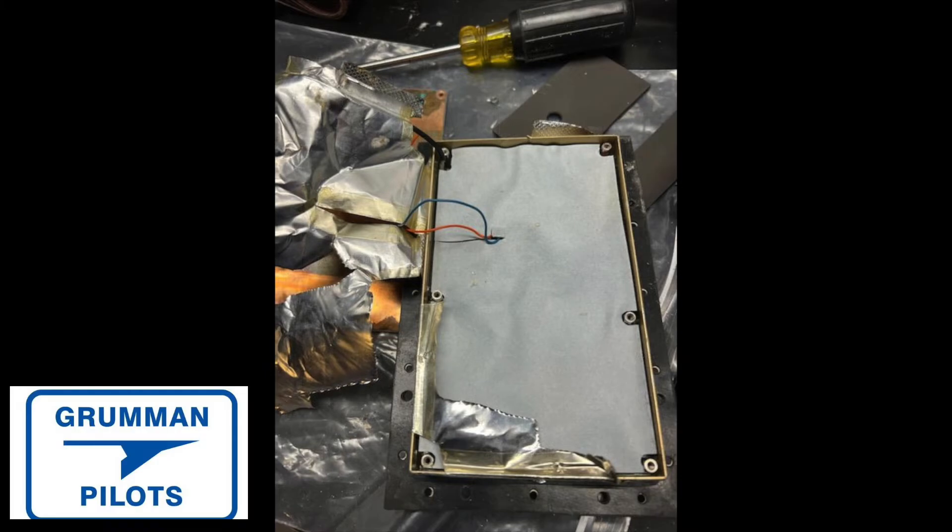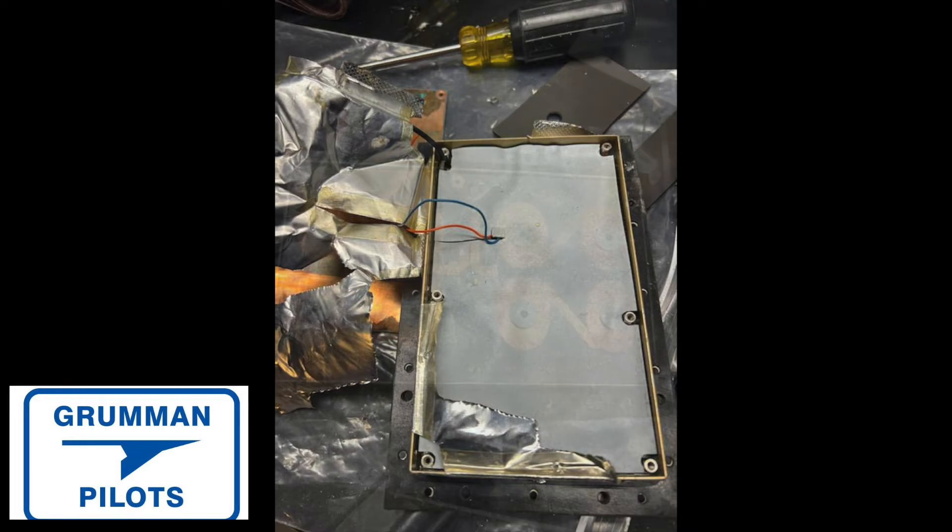It's usually for larger category aircraft. Here's the antenna coming off the belly of the aircraft — it does weigh quite a bit, so there will be an adjustment to weight and balance. Radar altimeters today are no longer needed in most cases, but if you were doing category one, two, or three approaches you might consider it; otherwise it's hardly useful in today's environment.